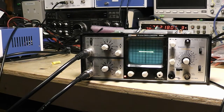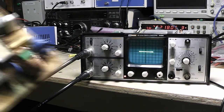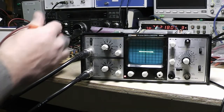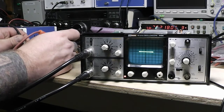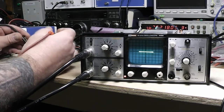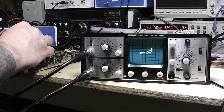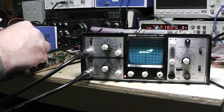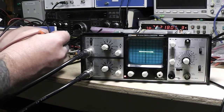The biggest advantage of these things — let me see if I can get both in the shot. Let's say I've got a board here with a row of transistors. I'll bring it over and do it like this — it's just a real quick thing. I'm not really going over curve tracers in depth, but when I mentioned it somebody would probably want to see it. It's working pretty good as a curve tracer. I've got different current limiting settings going through the part, and this board isn't plugged in of course. Going to the next transistor — next one, next one — looking pretty good.